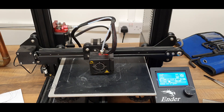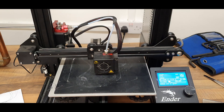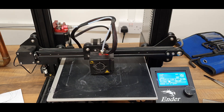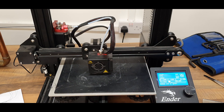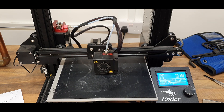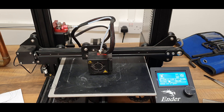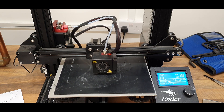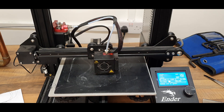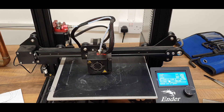As you can hear now, this is virtually silent. All you can really hear is the fan noises. You can change out the fans — what you need to be aware of is that if you change the fans out for Noctua fans, which are much quieter, they're quieter because they move less air. They've got higher quality bearings and things like that, but ultimately the reason why they're quiet is because they move less air. When you do that to the hot end, there's a fan on that which directly cools the heat sink. If there is not enough air to cool that heat sink, then you'll get heat creep — where the heat moves up the heat sink and into the Bowden tube — and it will start to soften your filament before it gets to the nozzle, which will cause clogs and other issues.